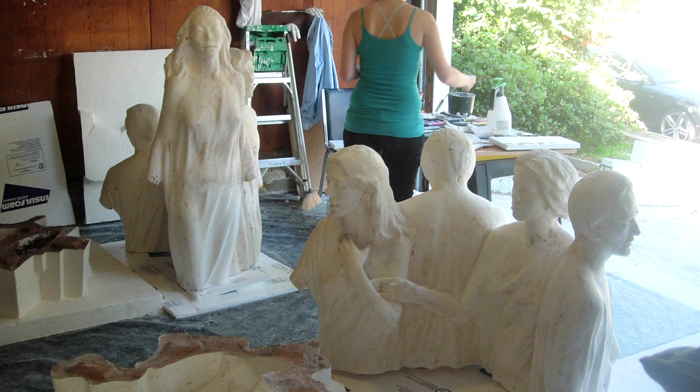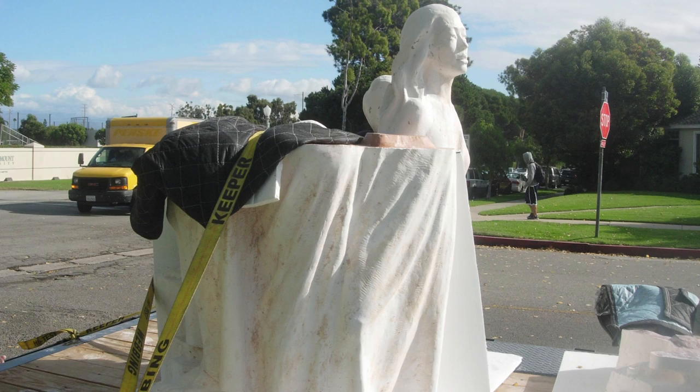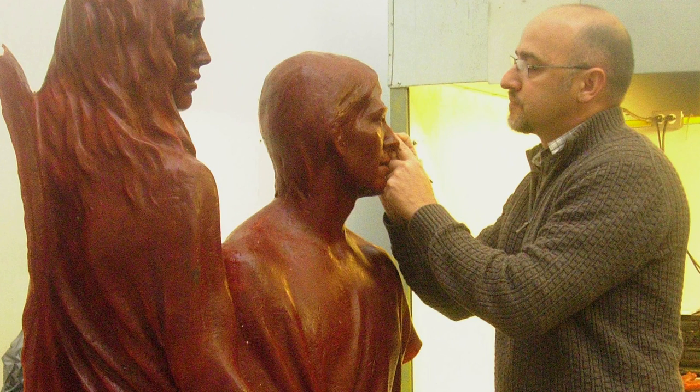The process works really well because the pieces came back together perfectly. Once the pieces are put back together, the outer shell is chiseled away. So we go from the positive clay to a negative plaster to a positive plaster, and that positive plaster is shipped to a bronze casting foundry. They're able to make a silicone rubber mold from the plaster, and from the silicone rubber mold they make a wax version. The wax version is touched up to correct any imperfections that may have occurred in the casting process.